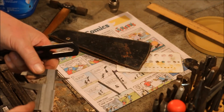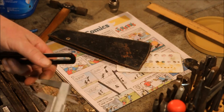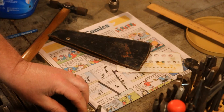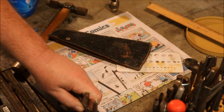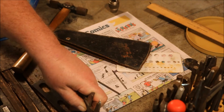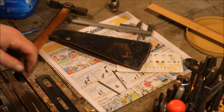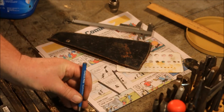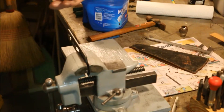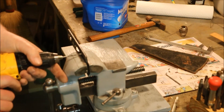Set my mics at 0.705. Strike a line in the surface, and somewhere along that line I need to put another prick punch mark — it's just a matter of punching a hole through.